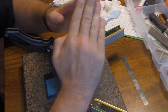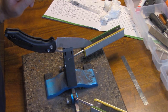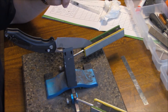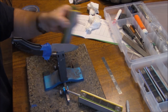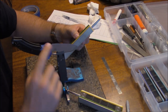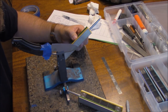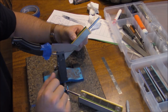Before that, I always take a little bit of tape and put it on here so I don't get any metal filings in the mechanism. Some people think it's a little overboard, but why would I want pieces of diamond and S30V grinding away at those soft phosphor bronze bushings? It just doesn't make sense. You invest in a good knife — take care of it. All taped up and ready to start profiling.